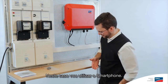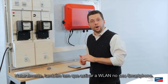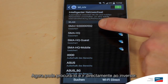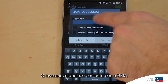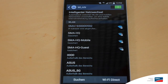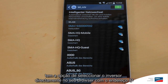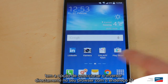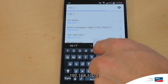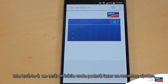In this case, I'm just going to use a smartphone. Of course you have to activate WLAN on your smartphone as well, then you can search for and go directly to the inverter. The inverter makes contact with SMA, and then you need the serial number, which you can find on the type label itself. When you have made the connection and entered the standard password, you have the option of selecting the inverter directly in your web browser at the IP address 192.168.100.1. This takes you to the home screen, from which you can enter all the remaining settings.